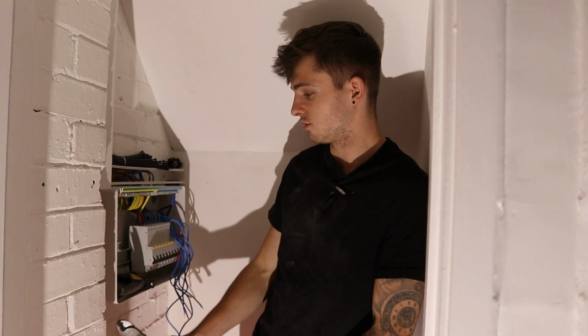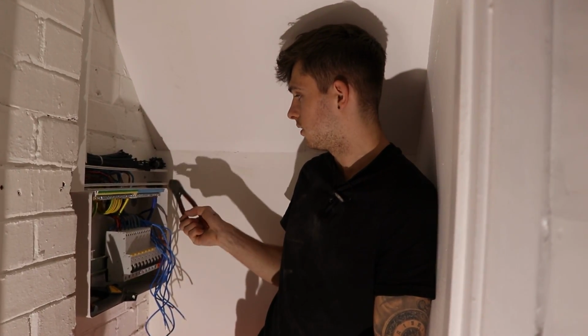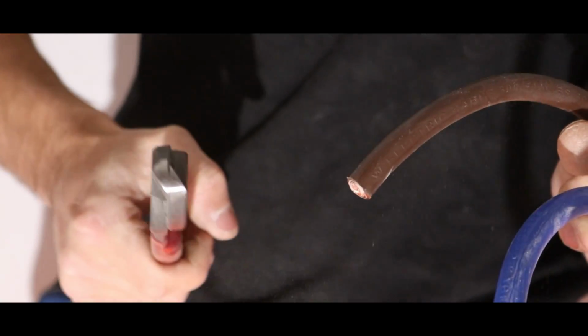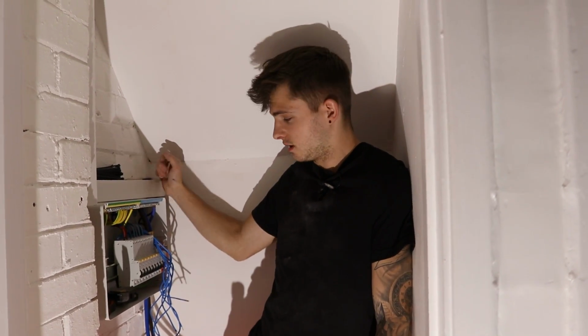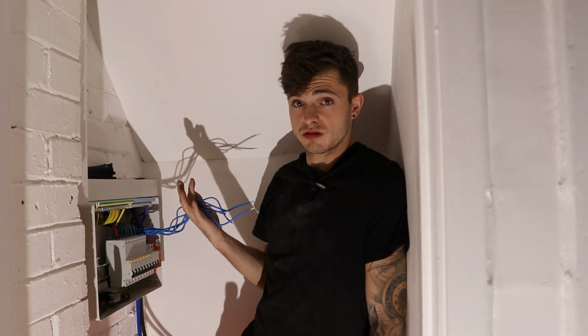Then I'll have my earth coming just straight up into here, boom, straight up in. So yeah, I'll get these in, trunking lid on, that connected, and I'll show you how I do my fly leads. So got the lid on now. I've got my tails into the plastic trunking and connected using the tail clamp, which is wicked. I've said this about 5 times now.